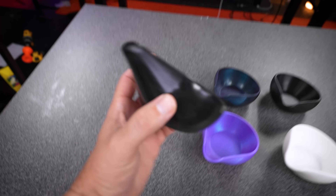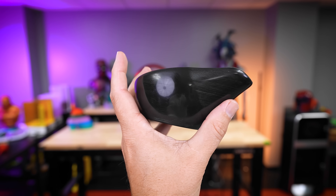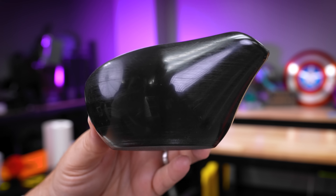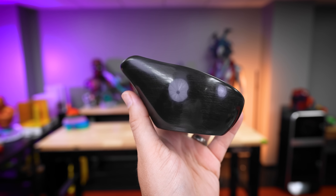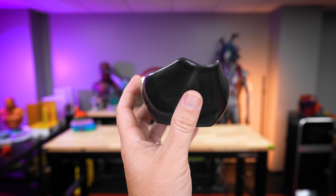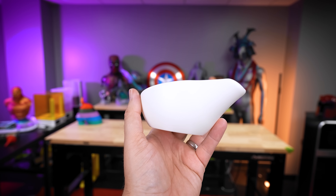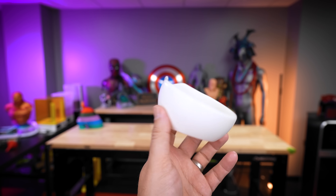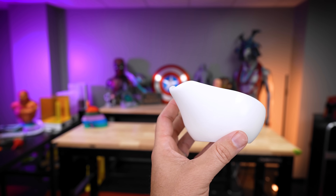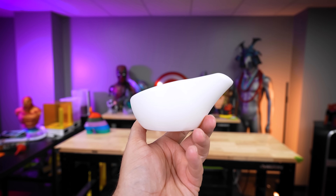First up is the black PLA print and this is so glossy and smooth. I'm honestly kind of amazed at how soft and smooth we were able to get this just by doing wet sanding and then applying this beeswax paste. I can even see my reflection directly in the print. I can still see scratch marks from the sanding process and even some layer lines, but it is so incredibly smooth to touch. Something like an auto body compound would have probably done a better job of getting out those fine scratches. The white one looks stunning — it feels stunning, it looks stunning. The white is going to be a lot harder to see the layer lines, and if someone just handed this to me I don't even think I would have considered it a 3D printed object. It is so smooth to touch and really seamlessly hides any of those seams.